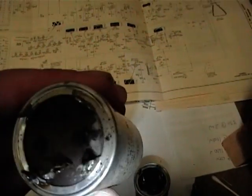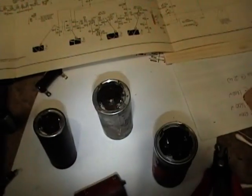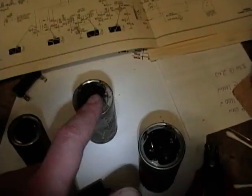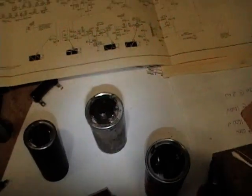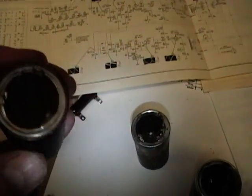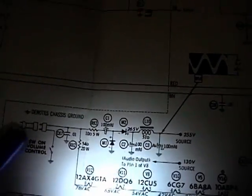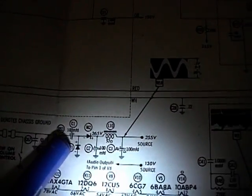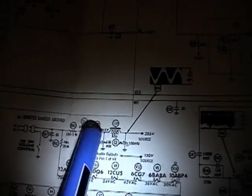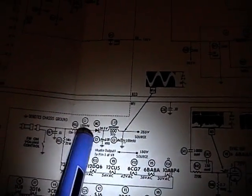Now this guy definitely needs to go. See that crud oozing out — it's kind of bulging there, so that's why you really want to replace these old electrolytics. This set may seem to be working okay, but this guy was definitely going to blow at some point. And this guy that's wrapped in cardboard — that was done for safety. It turns out that cap is coming right off the AC plug through this resistor, and all the AC power that goes to the voltage doubler goes right through that cap. So both sides of it are at a pretty high AC potential.